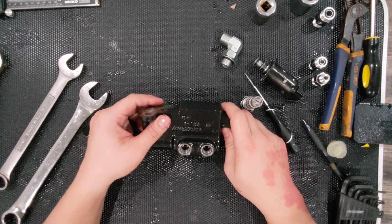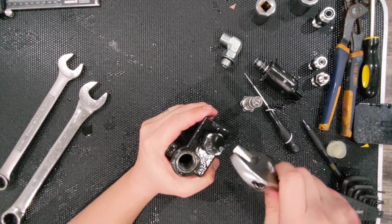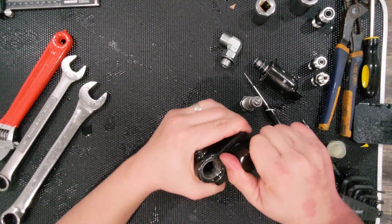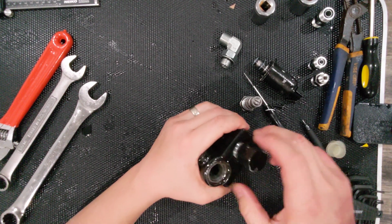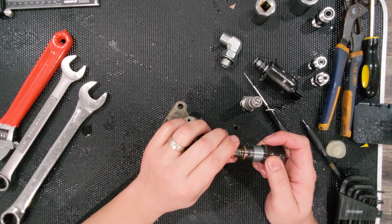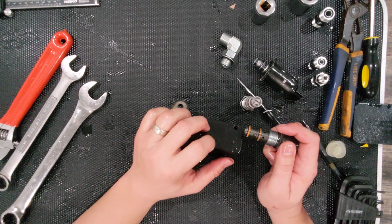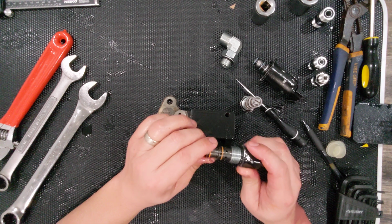So in my test, I've turned it down. I don't have a hydraulic flow meter yet. I hope to have one soon. They're very expensive, so I'm trying to hold off, but I want to make sure I have one just so I can understand how much flow, because some of this is theoretical. With some of the applications I'm going with, they say the lowest is 2 gallons per minute. I've scoured tractordata.com for different subcompact tractors to see what fluid volumes they're sending to their steering cylinders, and I think the lowest one I've seen is on a 25 horse New Holland, at about 1.5 gallons per minute. Kubota really doesn't tell you how many gallons per minute. I haven't run across any of the BX series. I'm sure some of the other ones tell you, but to me it wasn't really clear for some of the BX series. Maybe I didn't look hard enough.